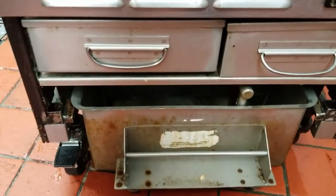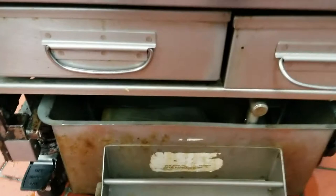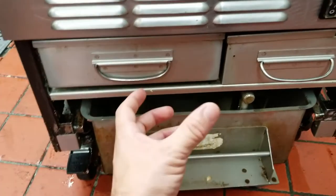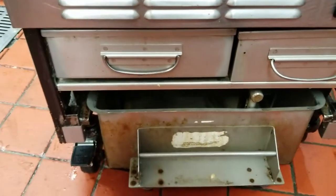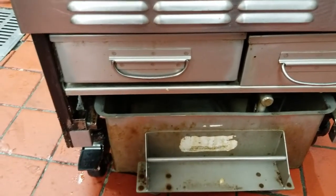If there's oil left in the fryer, pull the filter pan out — there's a little thumb latch on the side, push down and pull it out. Take the cover off and put it back in. When you take the drain valve off it's going to spill oil, so if you can remove the actuator first and open it by hand that'll save you headache. Otherwise, expect a small mess.